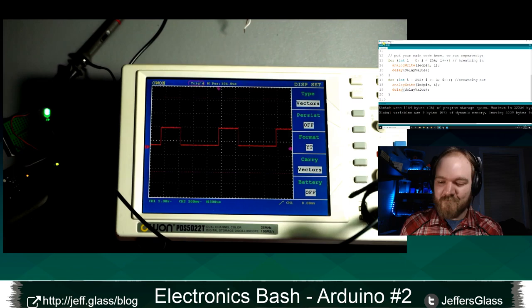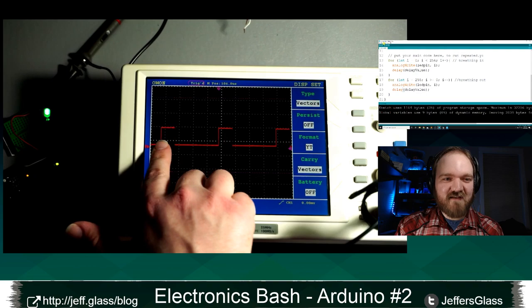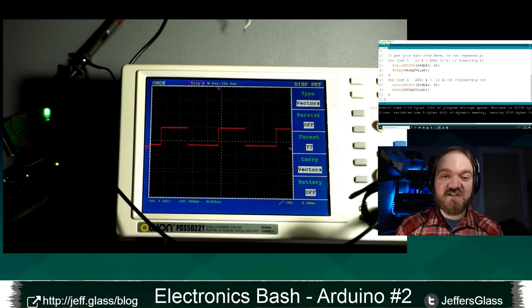And so what you're seeing here is a graph of exactly that kind of pulse width modulation that we were looking at. And each one of those pulses, each one of these values on the screen, is a variable pulse. And you'll see as the LED gets dim, those pulses shrink. And as it gets brighter, those pulses get longer. And we're just currently moving in a loop, where that gets very small, and then it gets very big.